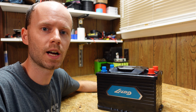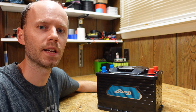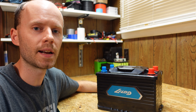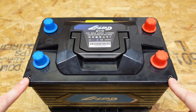The BMS shut it off at around 9.85 volts, which is slightly higher than the 8 volts listed on the specification sheet. We measured 107 amp hours, which is 3 amp hours short of its rated capacity. I have to wonder if the cells are just out of balance, based on how it shut down at the top end of charge as well.